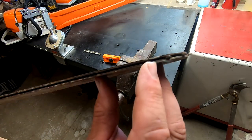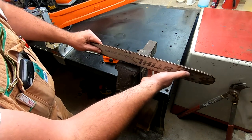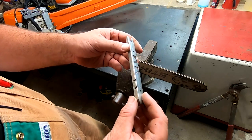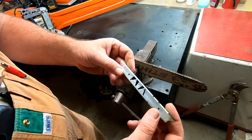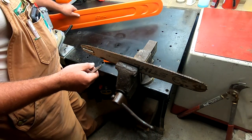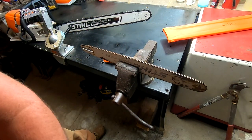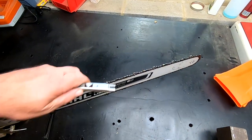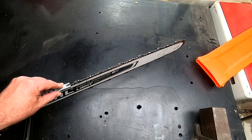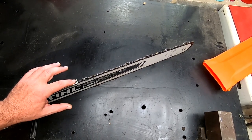You can even see where it chipped off a little bit. What we're going to do is go through this, clean it up real good. First step is to clean it. I've got a little tool here — a really interesting little guy that does lots of little tool jobs. It'll let you see how high your depth gauges are. If you lay this on top of your chain — this is a carbide chain we've got — you can see how that should be even when you lay it on top of the cutters.